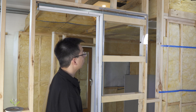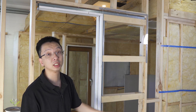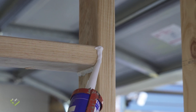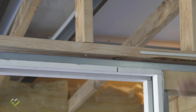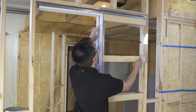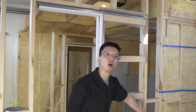To deal with that, we need to create an encapsulation. First, identify which part of the stud frame forms the pocket housing the sliding door. Step two: use caulking mastic to seal the junction of this pocket of stud frame, both top and bottom. Then — and this is the interesting part — we use low profile memory foam strip, typically used for door and window seals, to create a gasket all around this pocket. When you install your plasterboard it creates a compression seal all around. The plasterer just needs to ensure plasterboard screws apply pressure all around this pocket.